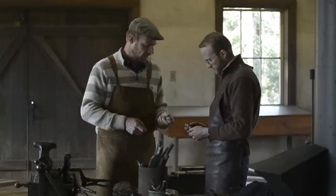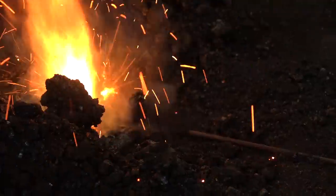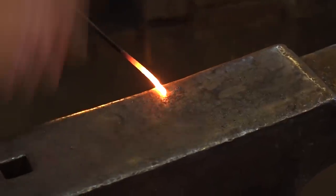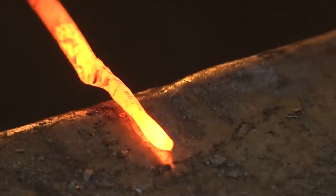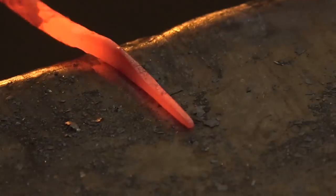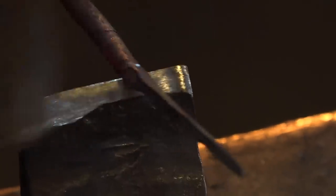Can you show me how you made one of those nails? Well, take your bar, draw that point down. And interestingly, these old nails, they tapered them, but they're wider at the point in one direction than the other, and they're wider at the top in the other dimension. So when you drive them in, they grip. That's interesting.